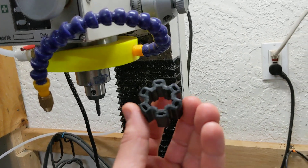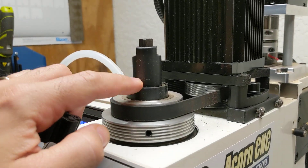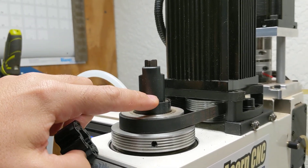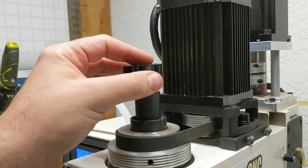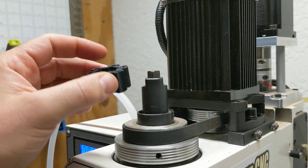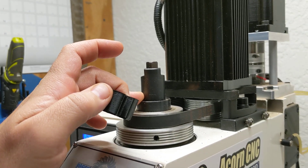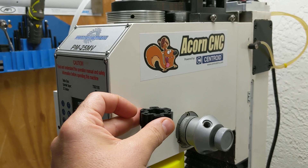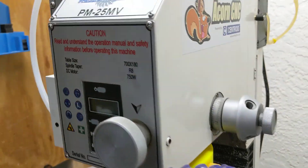The way I accomplished that was with this bushing. In this setup I actually left the spring and everything in there. What I did was I took this cap off, took the spring and everything out, slid the bushing down over the spindle shaft, pushed it down as far as it could go, and put the spring back on top of it. So the bushing slid all the way down to the bottom of the channel and the spring sits on top of it.